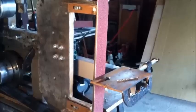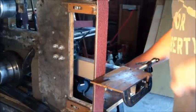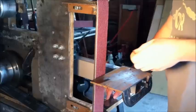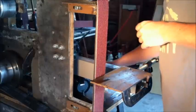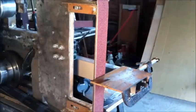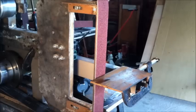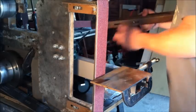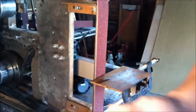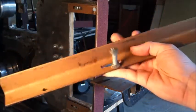You're going to need a 2 inch belt grinder for this. I made my own because I just didn't feel like going out and spending $2,000 for a knife grinder, so I made one for about $400. I also made a jig of my own, just out of angle iron, and this is how I cut my bevels in.